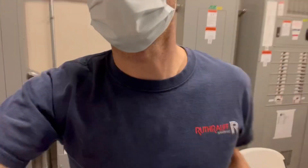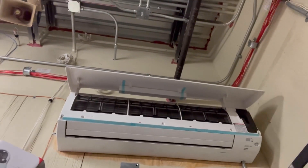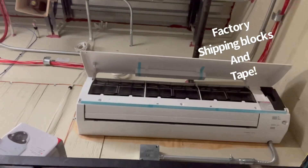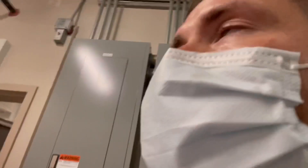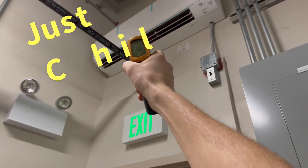I went to another room — I don't want to show the facility, so bear with me. You've got the shipping block still there, the installation foam, and the installation tape. That's telling me somebody probably didn't do a proper startup. We go to our last unit here — I've already messed with this one, bear in mind. 54 degree air — that one's cooling.